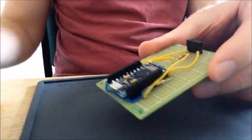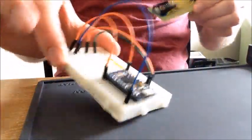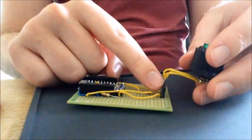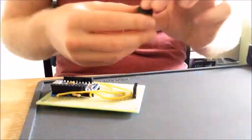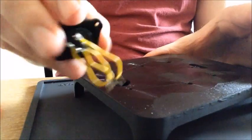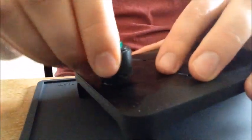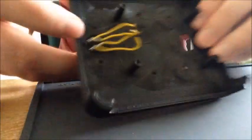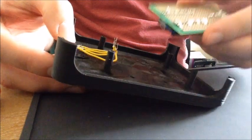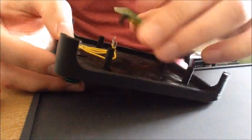That's the heart of the mechanics. As for the electronics, it's based around an Arduino — I prototyped it up on breadboard and then soldered it up to create a permanent circuit. This has a button, and it's a light-up button with an LED in it, which plugs into a little header so they're all nicely connected up. I have the stand here which the dinosaur stands on, and the wires pop through and the button sits nicely at the front. The wires hop through here to these pillars, which is actually where the circuit board screws in — it's got holes and they just fit nicely like that.